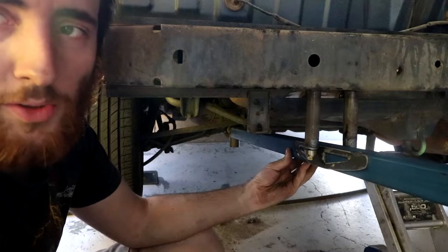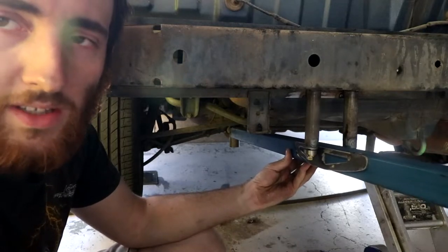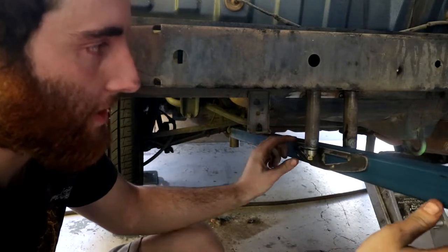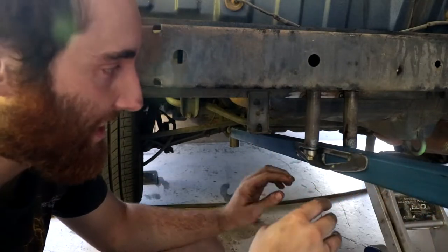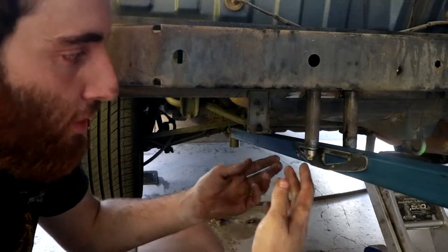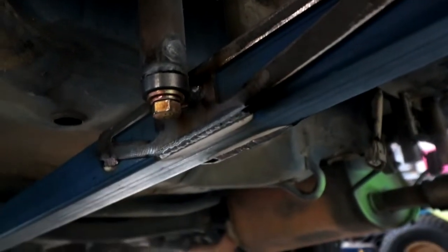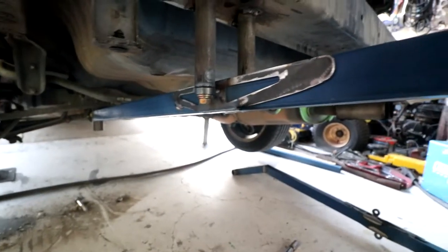So this is the last opportunity to make any tiny little adjustment to the angle of it. So I'll bolt the other one on, we'll get them both exactly right, final adjustment, it has to be right, and then tack them in place, pull them off, weld them, reinforce them, do whatever else we need to do. Okay, so I've just welded those a bit more solid and welded these reinforcements on a bit more. We're ready for the stand test.